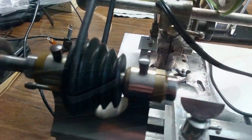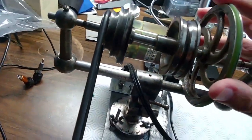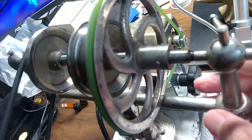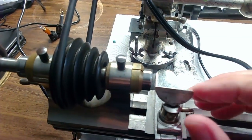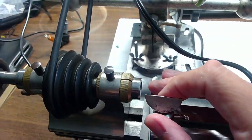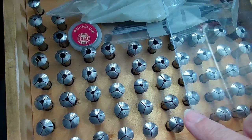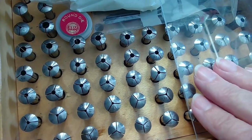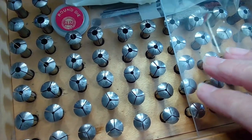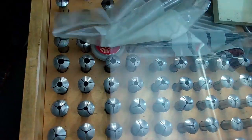You're going to need a decent watchmaker's lathe. I've got a very nice Boley watchmaker's lathe with a countershaft going over to a sewing machine motor to drive it — a very nice setup. You do not need the tailstock for this, but you do need a flip-over tool rest; a non-flip-over tool rest will not work for making a balance staff. You'll also need a full set of collets, because you'll need the initial collet grabbing the blued steel, and then when you flip it over to finish off the other end, you'll need a different collet to grab the hairspring part of the balance staff.